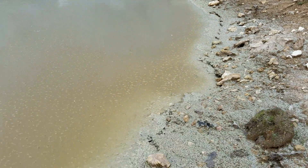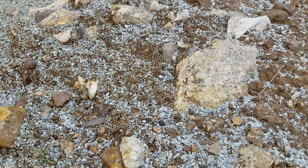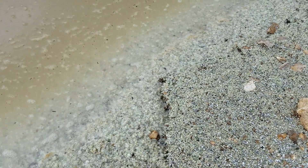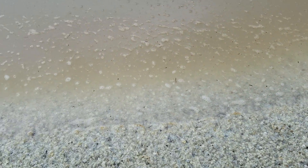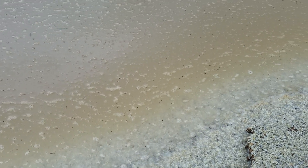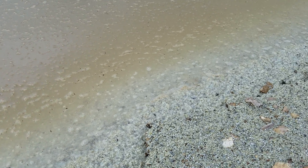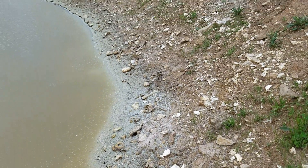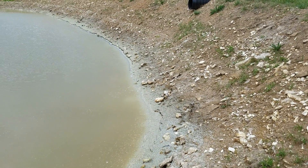As you notice on the ground here, they're just little granules or clumps, but as soon as they hit that water they expand quite a bit into a sort of slimy mud that seals pretty good. So I'll just keep sprinkling and hopefully at some point it'll seal and we won't have any seepage. I'll check back in in a few weeks and let you guys know how it worked.